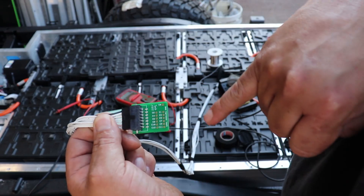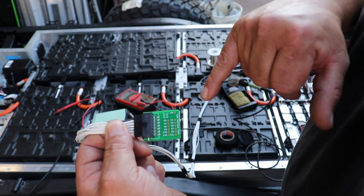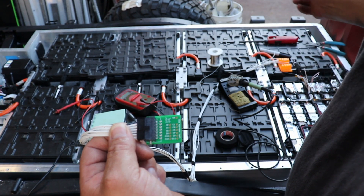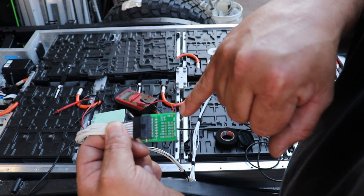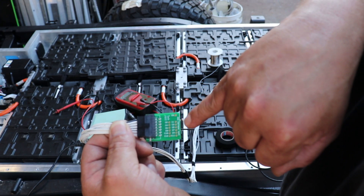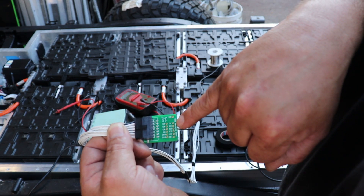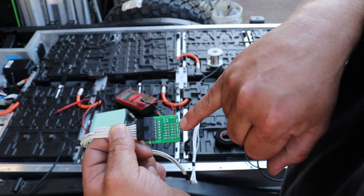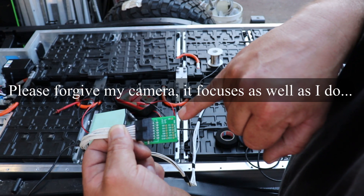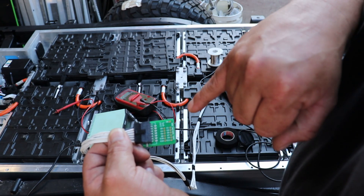What I have here is the BMS harness tester. You take your voltmeter, and as you're wiring this all up, each cell I wire into the BMS I check. You go from cell zero — the negative most — to cell one, put your negative on your voltmeter there and your positive on cell one, and it should read roughly 3.7 volts, which is the nominal voltage for lithium. Then you move your negative to cell one and positive to cell two — again 3.7 volts — and so on. You should see an even increase on each cell: 3.7, 7.4, 11.1, so on and so forth.